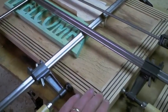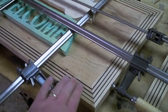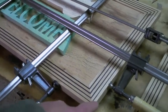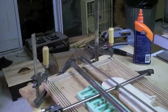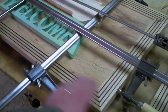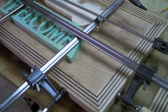Here's the beadboard piece where I went ahead and planed it down, just leaving these pinstripes. People wonder how you ever got it in so neat and precise. It's nicely picture framed — this worked very well. It had two corner clamps holding things even, and it worked very, very nicely. There are no fasteners of any kind except the glue. The temperature of the shop tonight means the glue will take a couple of hours to dry.